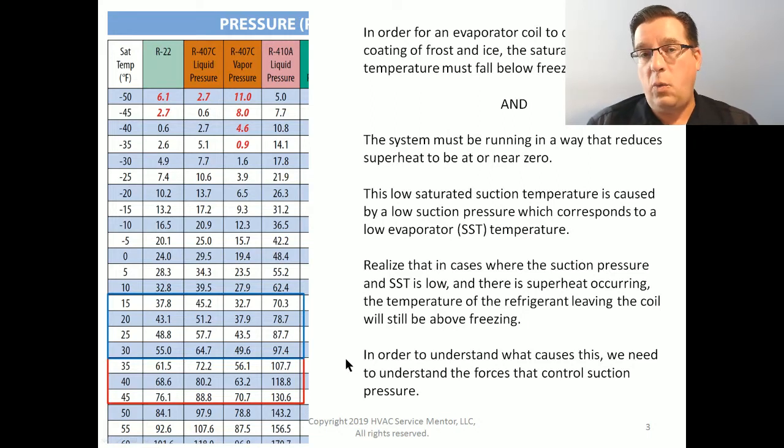Can you think of any case where the quantity of refrigerant in something does not affect its pressure? I can think of a refrigerant cylinder. And you can easily check this yourselves. In your organization, I'm sure you have some refrigerant cylinders that are completely full, some that are somewhat full, and some that are almost empty, but not entirely empty. If you put all those three cylinders together in the same environment and measure their pressure, they will all be the same. Interesting. Whenever there is saturated refrigerant, its pressure is dictated by the pressure and temperature chart. It's not dictated by how much refrigerant is in the thing. And that is a very important distinction to make.